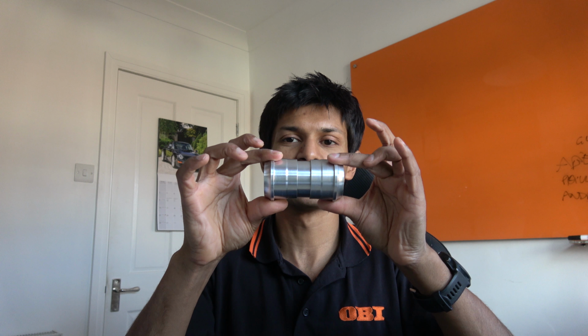Now I've almost created a rod for my own back with these things, because I only machine from one side. So when you put this in the lathe to machine it, if my finger is the cutter, it comes along, does that, machines all of that, and it machines these things also in one go. That's the way I do it, because it's more accurate.